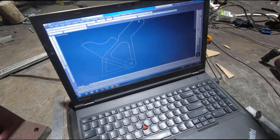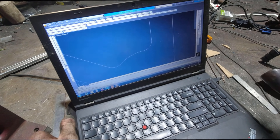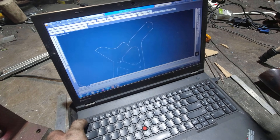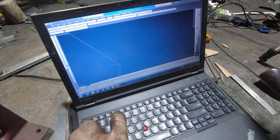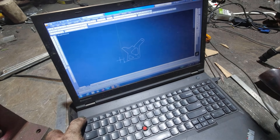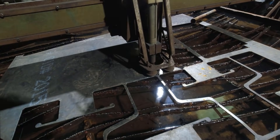On the top flap, all that needs to remain solid because that's where I'm actually going to be mounting the socket. Lead-in, lead-out, open up a segment, polyline edit, join. Next I align it to XY0, set it up on a machine origin, and that's about it for the drawing. Export it as a DXF, and then off to the plasma cutter.